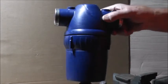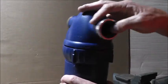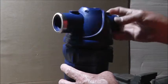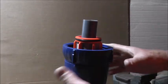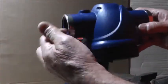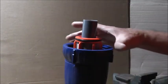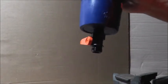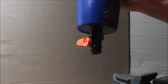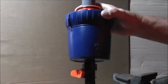As far as the filter itself and recharging it — yours is already charged when you get it, we send them out charged. But if you've already installed yours and you need to add polyphosphate to it, you want to check it. It's pretty simple. You're going to take the bottom off. Your top is going to be permanently installed in your plumbing system, so you'd be screwing the bottom off. First, turn your water off. If you've installed a bypass around your system, then once the water is turned off by your bypass, you can open the drain valve and drain the pressure off of the filter housing and drain the water out so it's going to be easy to service.